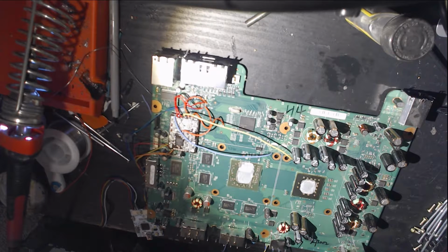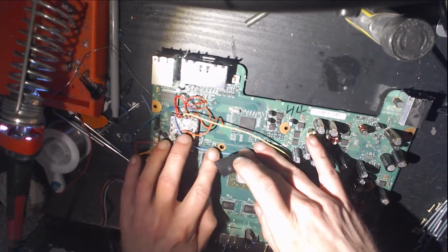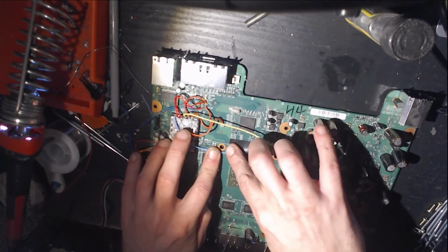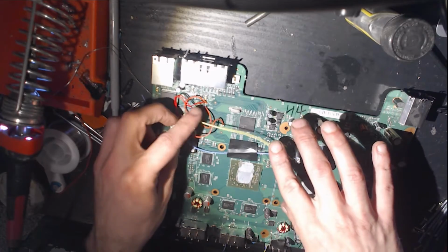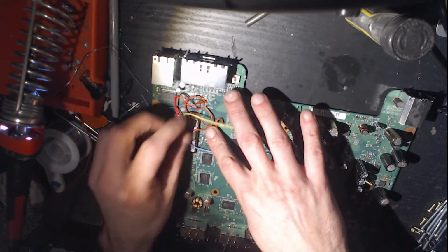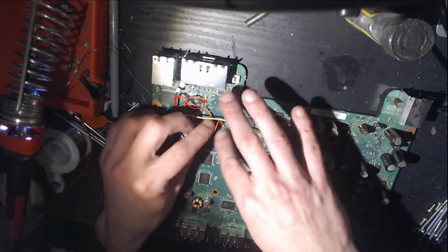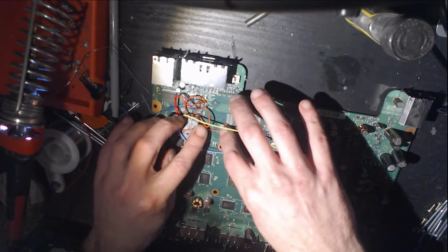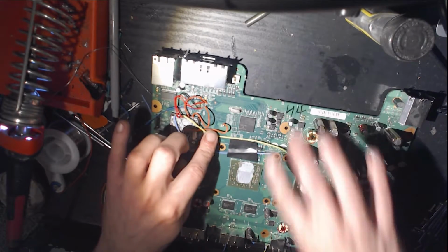I do not recommend using hot glue. A lot of people love going apeshit with hot glue. I think it looks very, very tacky. Electrical tape will keep your wires in place. And some may argue electrical tape might look tackier. That's fine. But it leaves you room to go back and fix something if you made a mistake. C, I like to run on the outside of the heatsink like that.